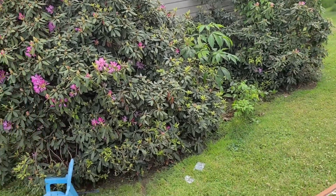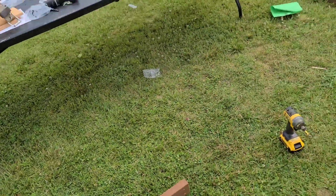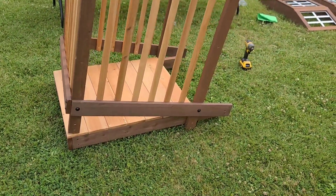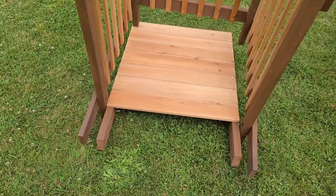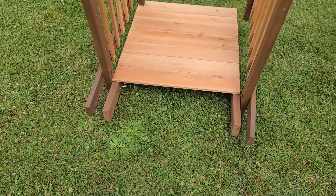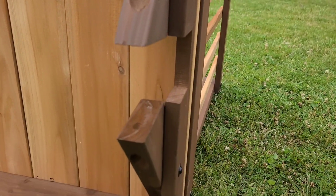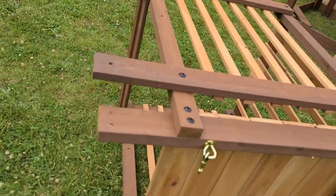Use two-and-three-quarters spacing for the spindles. Now we're going to bring it over and set it down on the flooring. This is where they're going to enter, so this connects to the fort. That's why I left off two boards - so I can work with putting it together when I get it up there. I put these brace boards on - that's what your swing beam is going to set on - then put your front end on.